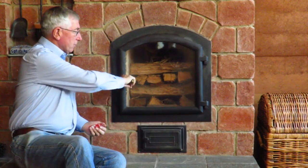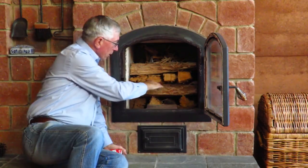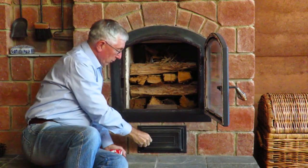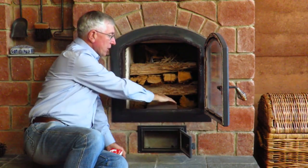This is the process of lighting our masonry heater. The fire's being stacked, as you can see, in a criss-cross manner so that air can penetrate the stack of wood. There's about 20 kilos of wood in there. We light the fire from the top — all the kindling's at the top. We want full air supply, so we open the air intake door. The air intake comes into the hollow frame, and the main jet of air is here.